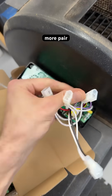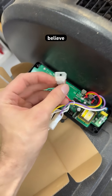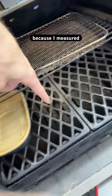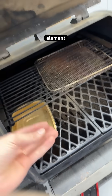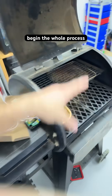Then we seem to have one more pair for an actuator — this red and white. I believe that will drive the heater, and that is only for the light-off stage. We're driving 400 watts — a little stick that has a resistive element that gets red hot to ignite the coals and begin the whole process.